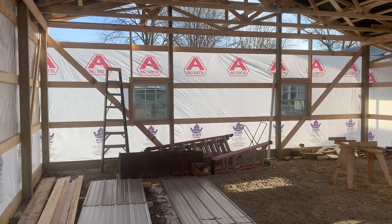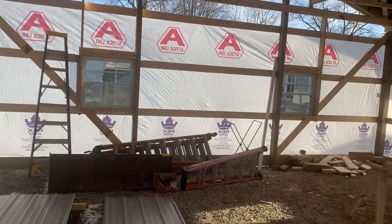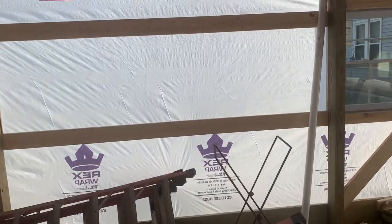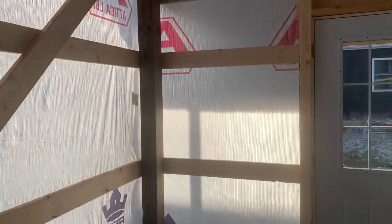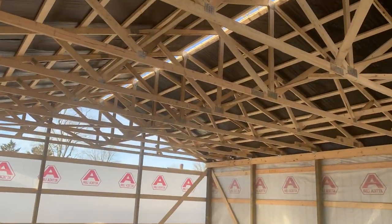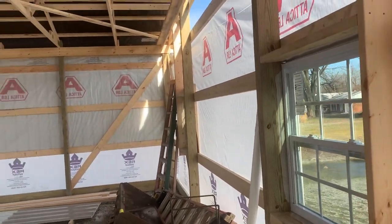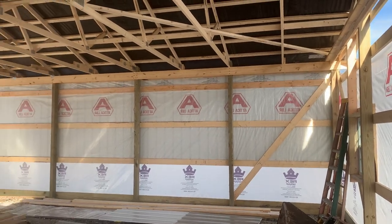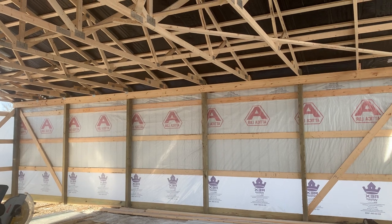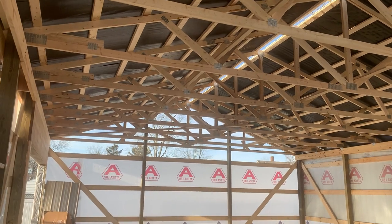With that nice 10 by 20 porch, this should give you some ideas. It's in the early stages - the guys are getting this framed up but it won't take long. The weather has changed, a little more chilly. I definitely want to stress this: put house wrap on your building. It's a nominal cost but it does some really practical things - keeps the moisture out of the building. Four foot on center truss spacing there.